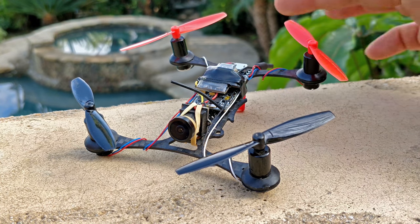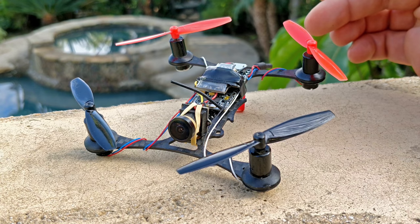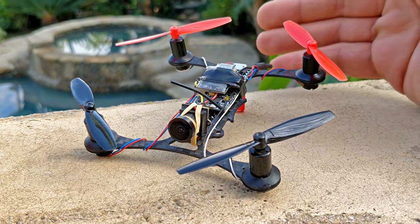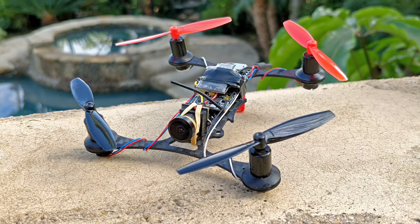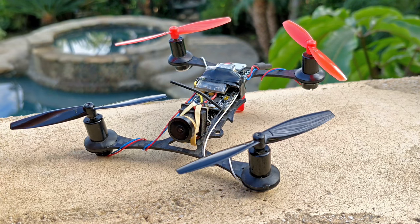I do think that brushless is going to be better, but brushless incorporates a lot more complexity into the whole system. I mean, brushless motors, brushless ESCs, brushless everything, and then the stacks aren't very good for little 16 by 16 millimeter brushless things. And already this flies super wonky. You have to jack up the anti-gravity to get it to stop wobbling when you punch the throttle anyways. I don't expect brushless to be better. I actually expect it to be worse.